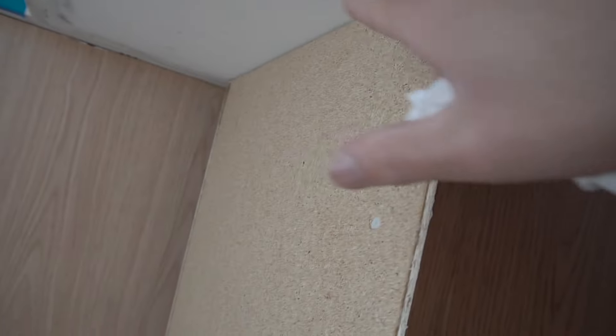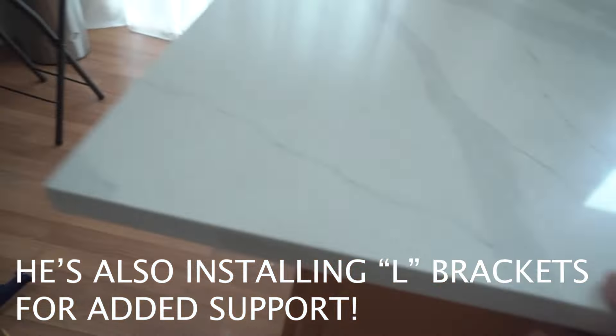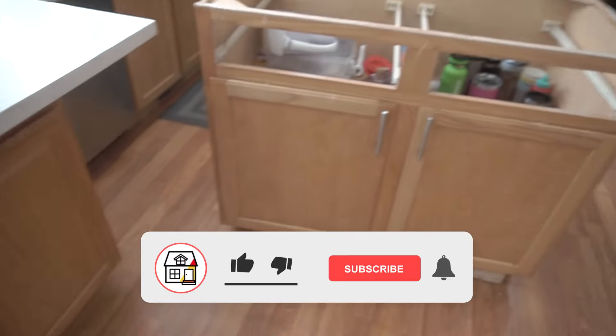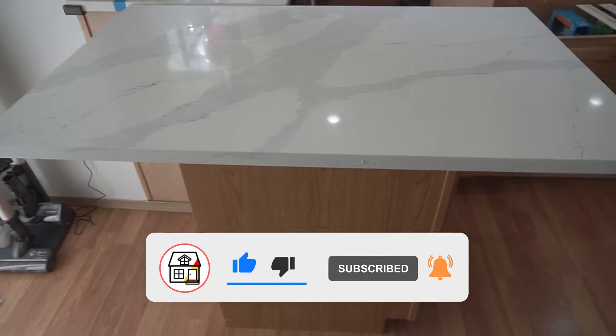Overall looks clean. My buddy T — after 24 hours this dries up, he's going to go around it with a bead of caulking and that should be it. This might be a little heavy on the left side since it's a heavy piece, but he's going to put heavy items like canned goods in there. You're going from a double cabinet to a single. If you found this video helpful, please like, comment, subscribe, and I'll see you in the next one.